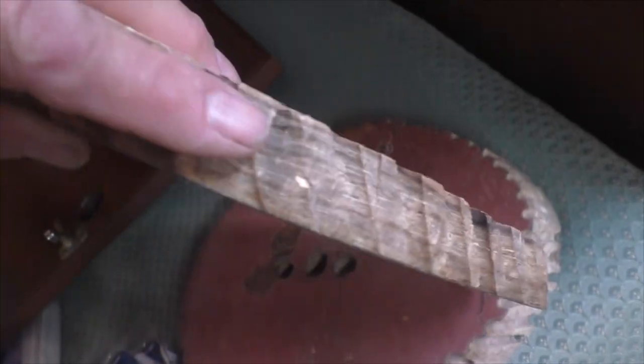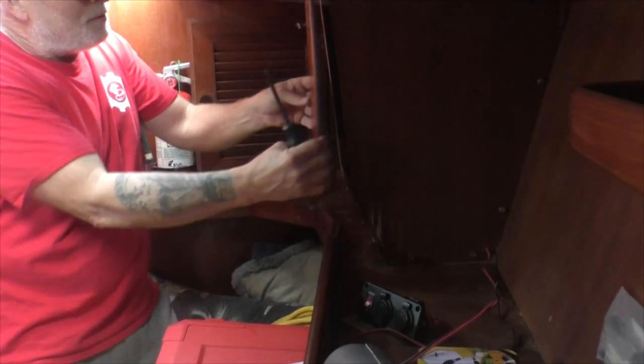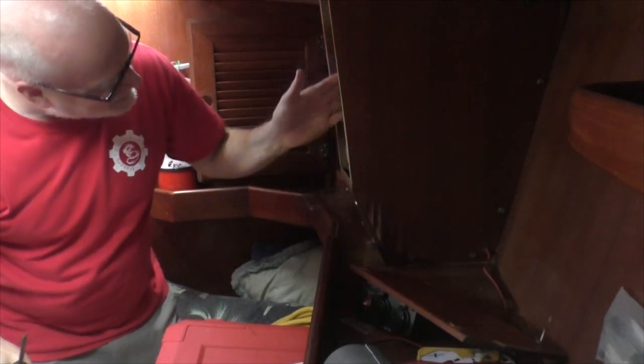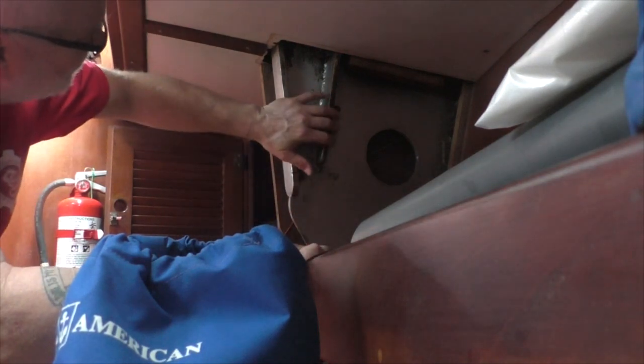That is the thickness of the hull up front, and you can see it's not cored — it's all solid fiberglass. If you're gonna buy a fiberglass boat, that's the kind of hull you want. This is the forward berth, and everything structural on this boat is hidden away behind some teak. That is a piece of stainless — that is amazing. That's all the structural hardware for the standing rigging up above us. It's a chain plate with lightning holes in it, but you kind of think why bother — this thing is massive: three-eighths inch thick and custom welded together. Up above on deck would be the pad eye where the standing rigging for the main mast attaches, and this thing passes two-thirds of the way down the side of the hull.